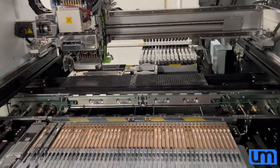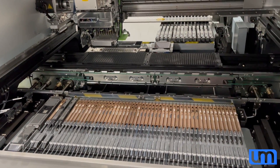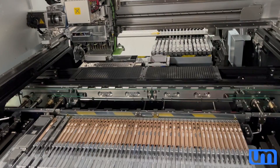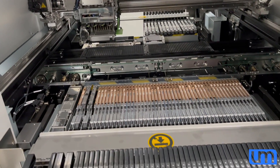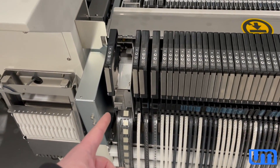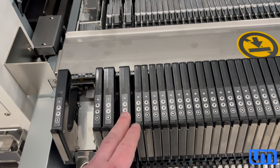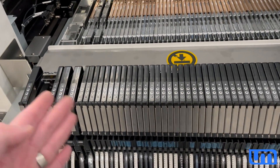A few people asked for a closer look at the inside of the machine. The machine is currently off — it makes a bit of a racket just because of the compressor and the amount of air it requires. But I have actually ordered the upgrade that moves most of the air stuff inside the machine, so it doesn't rely on my external compressor as much — it's going to save quite a bit in power and noise. You can see the feeder bank at the front: these are all 8mm feeders, a couple of 12s, and then there's the 44mm for the ESP32 mini modules. The 12 and 16s only take up two slots, whereas on my previous machines with the CL feeders a 12 and 16 took up three slots.